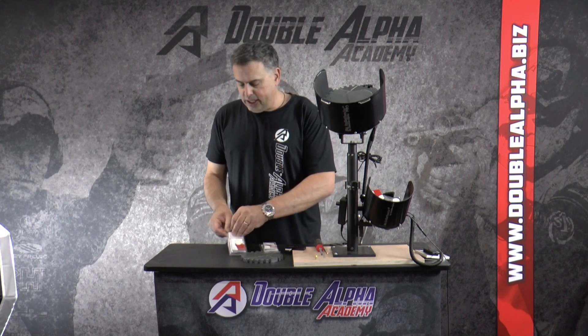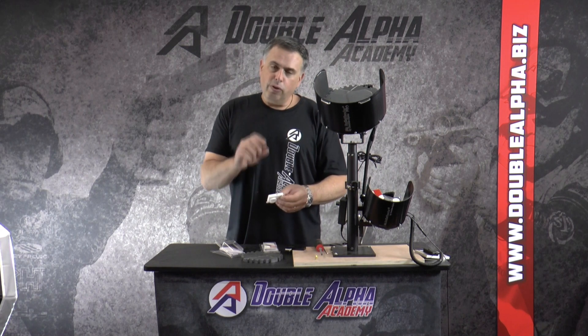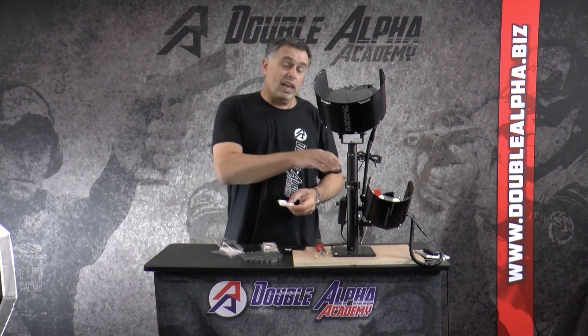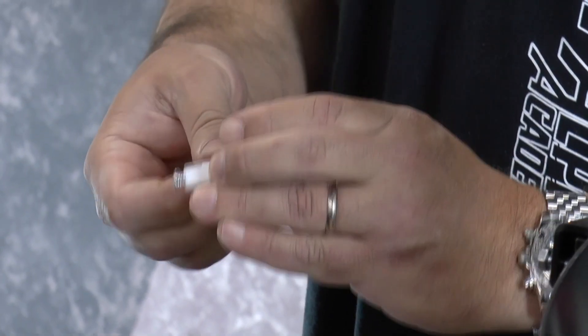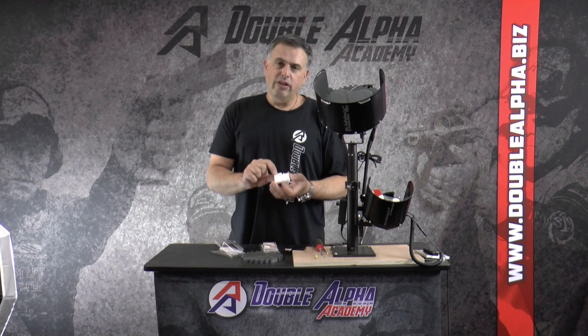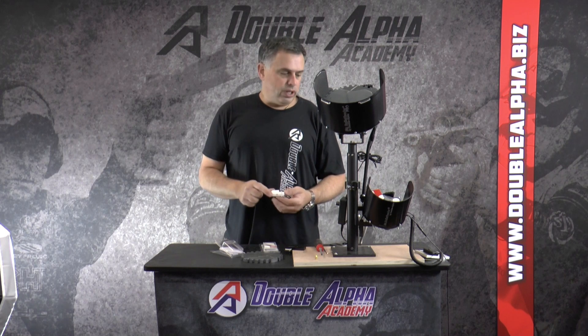Setting it up is important — you need to take time to make sure that you've positioned the nose guide exactly correctly. To make that a little easier, we've included in the nose guide an adjustment screw which can be used for precise positioning of the nose guide to create just the right amount of ledge that will allow the part to function as it should. To access that screw for adjustment, you do need to remove the spacers — there are four of them. Once you remove those, you have access to the head of that screw. You don't have to use the screw; you can slide the nose guide up and down the way you usually do, but the screw makes it easy if you want to make a very minute adjustment.